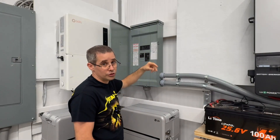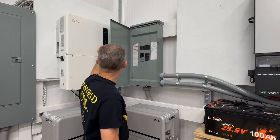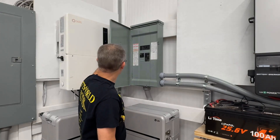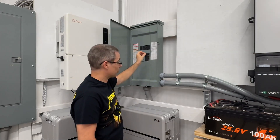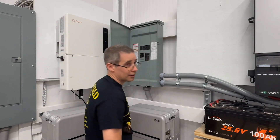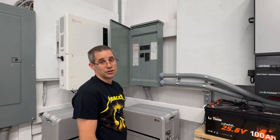I'm going to flip the switch off, lose power, then flip the transfer switch to on for the Solus, power up the panel, which will feed into my main panel, and we can start testing.